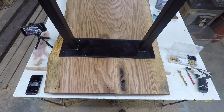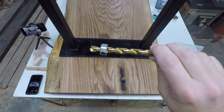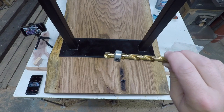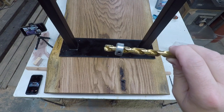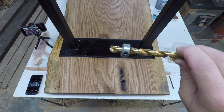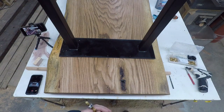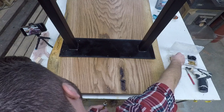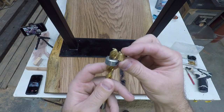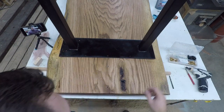So we're gonna swap out our drill bits. I've taken the actual drill bit required and I took my stop collar from my Kreg jig and put it around here. What that's going to do is stop it from going in too deep, which will give me a little bit better positive reinforcement. You can see I'm going just a little bit deeper than the depth of my insert, so I'll go a little bit more in case we have a little more room to work with.